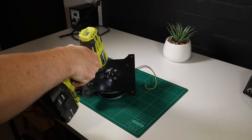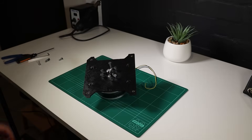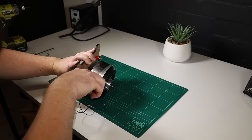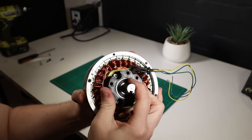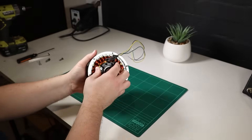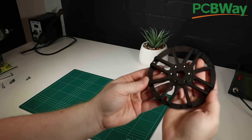The solution I came up with was pretty horrible so I was determined to do something better, and that's when the idea hit me. We can just make a new top for the motor that mounts onto the back of the motor bell, which is already neatly machined and has mounting holes, and then just cut the old top of the motor off with a grinder or a hacksaw. No lathe needed. So I whipped up a quick design and sent it off to PCBWay.